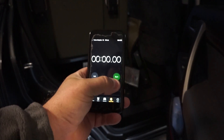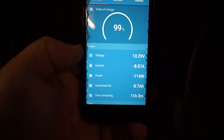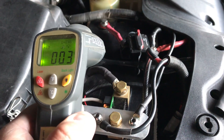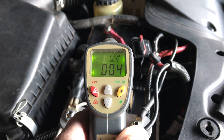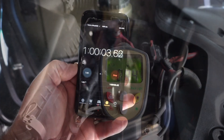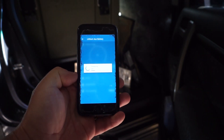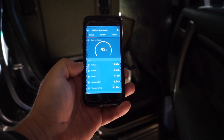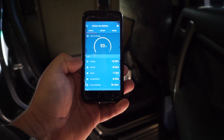We'll start our stopwatch. After a couple of minutes the amperage has stabilized at 8.55 amps. I'm also curious to see whether the battery generates any heat as it's being discharged — at the moment it looks like it's 4 degrees Celsius; it is the morning so it's cold. We're an hour in now. Let's have a look at what our battery is doing — we're down to 93% and the travel buddy is still pulling 8.6 amps.